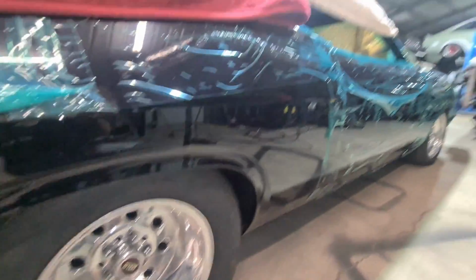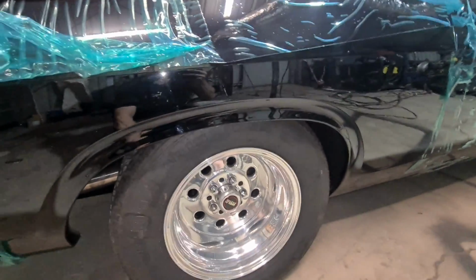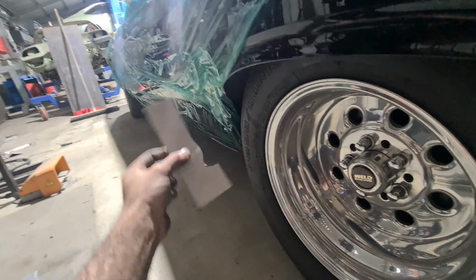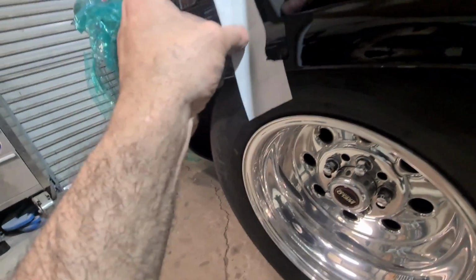Now it's my understanding there's going to be a lot of bog in this quarter, and I hate bog dust in the shop, so I'm going to paint strip the section out that I need access to, and we'll see how we go. The inners are also sheeted, so I have to take that into consideration as well for access. So just cardboard template, checking the profile between each side and comparing the difference.